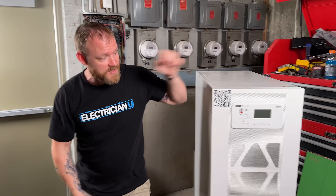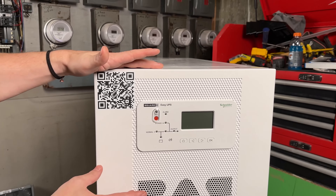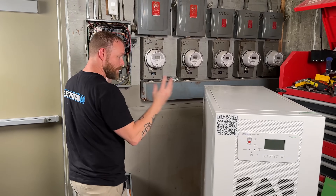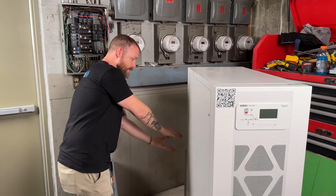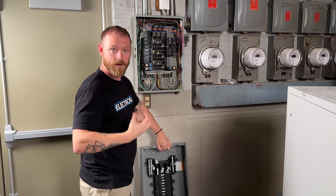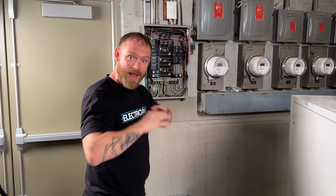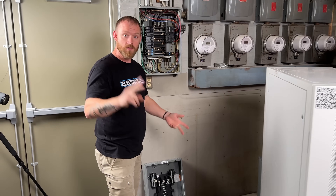So today I am going to install this beast. This is a 10KW three-phase 208-volt UPS, which means it is three-phase and gives me 208 volts of battery power. What I'm going to do is run power from a three-pole 50-amp breaker into here, and then come back out and install a panel under it. This thing drives that entire panel, so during a power failure it's going to instantly switch over without any loss. Every critical load — every server, computer, everything I want to run — goes through that panel.